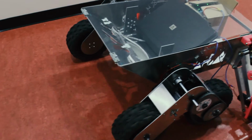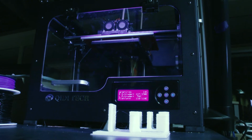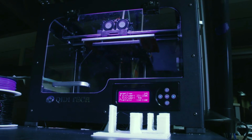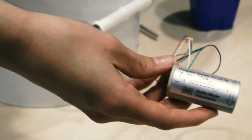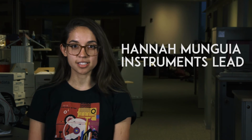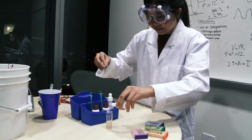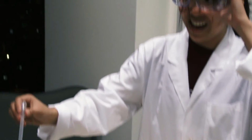Once we obtain the sample, we will transfer it to the chassis and use our Raman spectrometer to look for evaporitic minerals with a 532 nanometer laser. Our final in situ test is a 3-axis fluxgate magnetometer so we can investigate habitability in regards to the magnetic field of Mars. Our off-rover test will evaluate samples for signs of life. We will test for pH, salinity, and soil texture in addition to our elemental colorimetric tests. In addition to these tests, we have also developed a biosignature wet chemistry lab unit that uses fluorescent probes to test for nucleic acids, amino acids, and hydrocarbons.